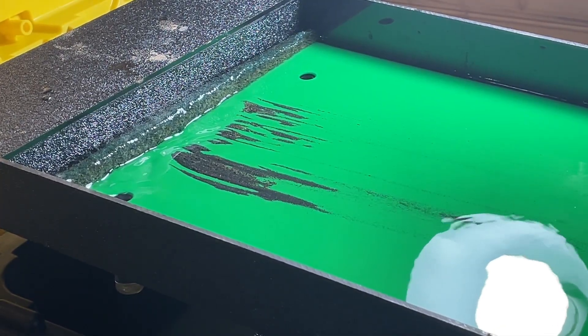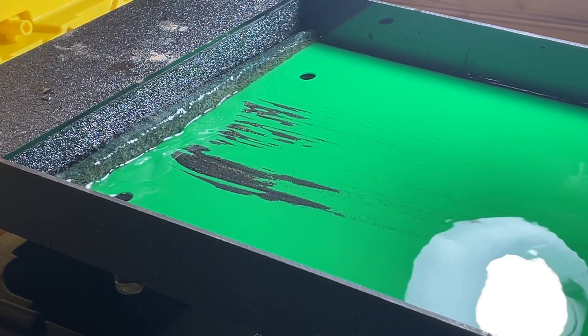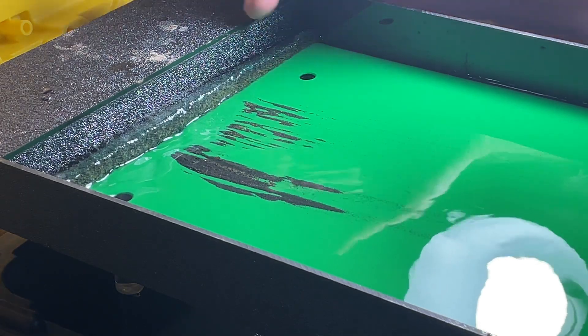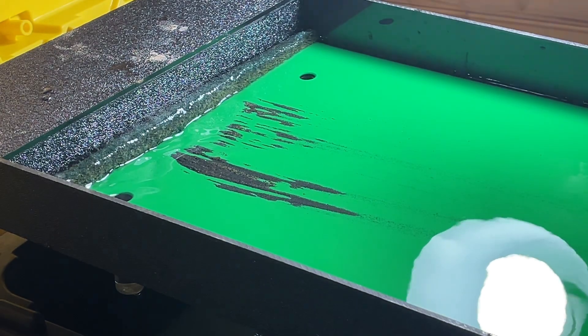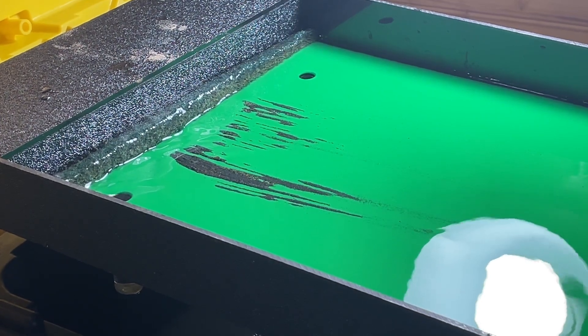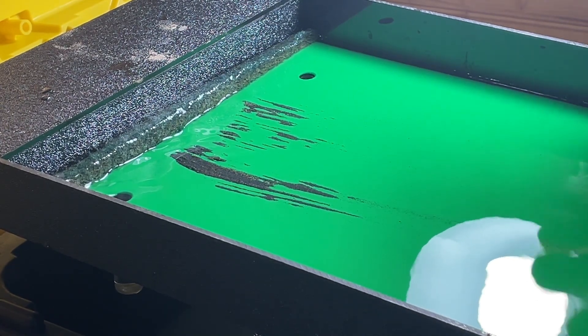So all you people familiar with the miller table will understand this already, but this is for the ones who have never seen a miller table in use before. What happens is I have a very thin sheet of water getting pumped through the pump here, coming out and creating like a mirror going across the surface of the table. You put your concentrates on there — since gold is a lot heavier than the material it's mixed with, if you have it classified down so everything is relatively close to the same size, the gold will sink to the bottom of the table. Gold is also hydrophobic, which means it repels water, so the gold hits the table and gets stuck there while the water flows around it and over it, pushing the lighter material off the table.